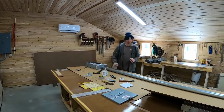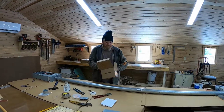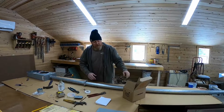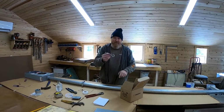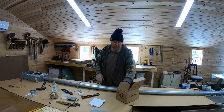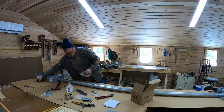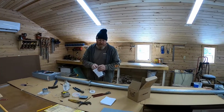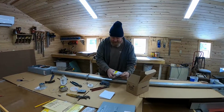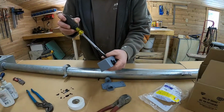Now what we got to do is when we get to the site, we have these 2 hole straps like this that go on the conduit. Every so often, we have a point of attachment that has to be screwed into the house, pointing towards the telephone pole for the utility. We have our ground kit here that we can show you. It's required by our utility anyways. I don't know how every utility is, but it's a grounding bar inside. I will open it up and show you.